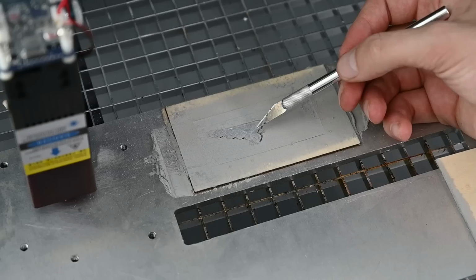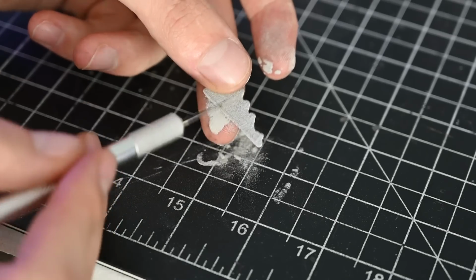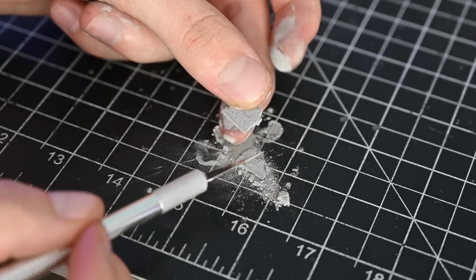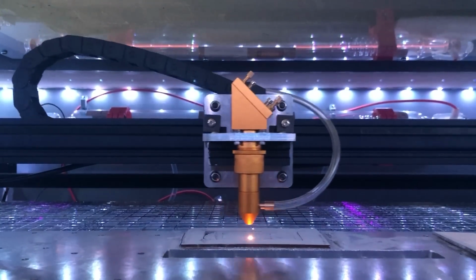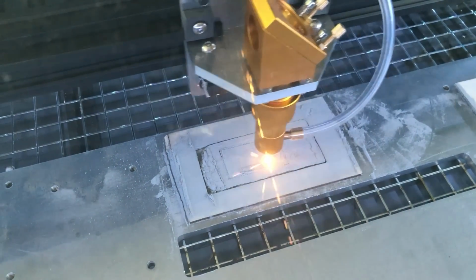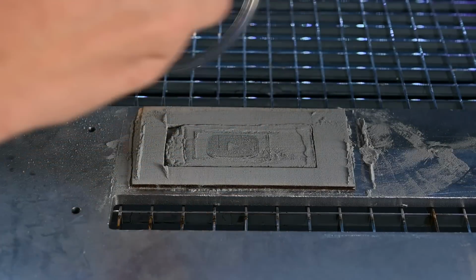Surprisingly, it kinda worked. The powder was at least somewhat stuck together, and the surface sounded like metal. However, the layer was extremely fragile, so I don't think it completely melted the metal. I also tried this on the CO2 laser with the air assist turned off, of course. It pretty much had the same results. I believe the lasers on a lot of metal printers are in the 500 watt range and use a much smaller wavelength beam, so I don't think there's any hope of making a metal printer with this, unfortunately.